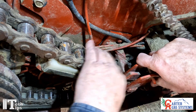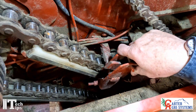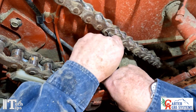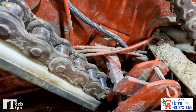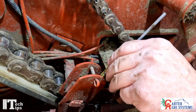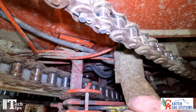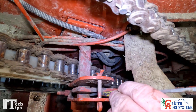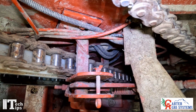We've moved this and we're fairly straight with our line. We'll go ahead and take our wrench and tighten up this top bolt. Then we'll take our pry bar, push down again on the door, and come over here to check our gap. Between this point and this point on the block, we check the gap and you can see we've taken it up to where there's hardly any gap in there anymore — and that's good.